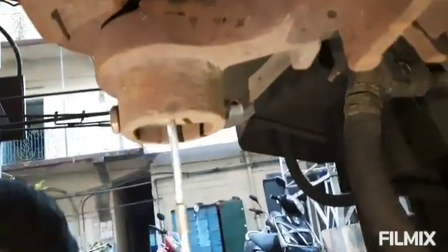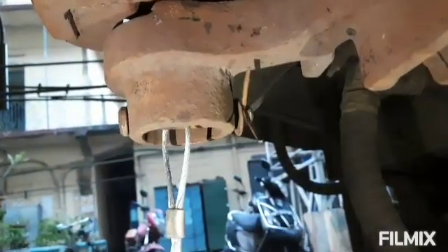After the completion of drilling, secure the lock pin with the coupler head and insert the modified lock pin through the hole. Especially note that the lock pin should pass through the oval shape of the toggle.